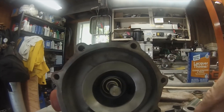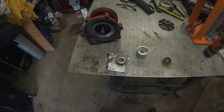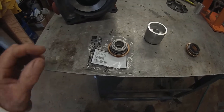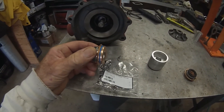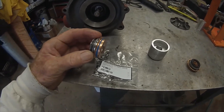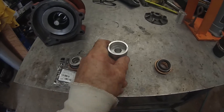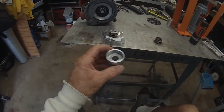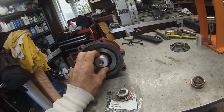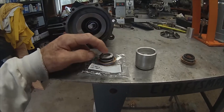Because we want to maintain a clearance between here and here. I received a new part today. There it is — this is a Volvo part, which I like because this piece has a blue strip of sealant on it. If you get the aftermarket ones, you're going to have to put sealant on this area here. What I had to make is this, and what this does is it pushes this onto that, so it's nice and square. The new part has got a spring on it and it flexes so much.